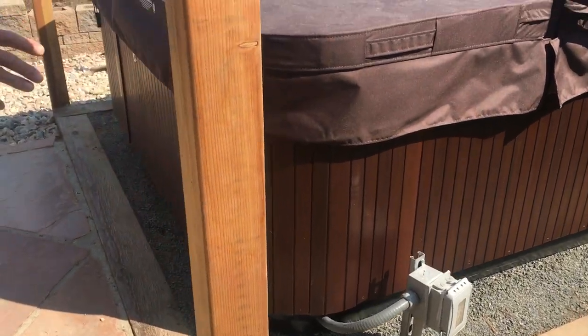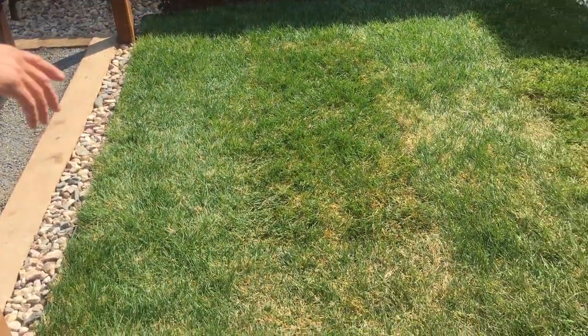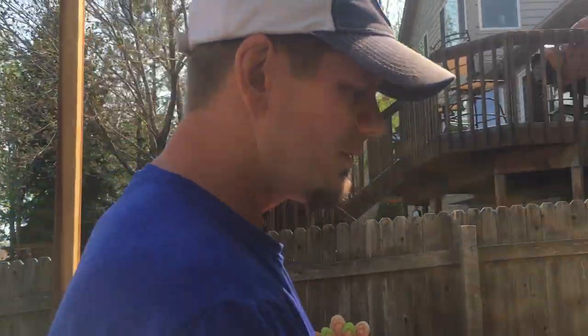This is really called an island. A lot of people call up, and by the time they've bought a hot tub and done their landscaping, they want the electrical for pretty much nothing. If you're trying to keep it more inexpensive for yourself — time and material from the point of the panel to the disconnect, the disconnect to the tub — that's very important how it runs. If we have a trip hazard and we have flex on here, most people say let's just keep it cheap and put the flex above ground. We can't do that. If the tub is against the house, creating a peninsula not an island, it's going to be more inexpensive.